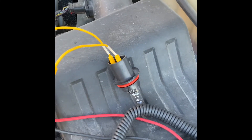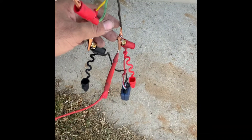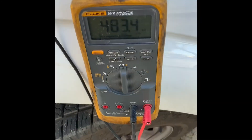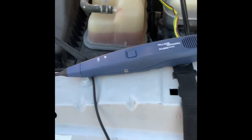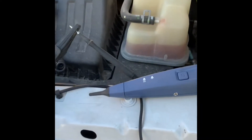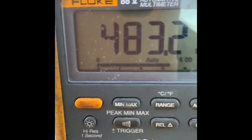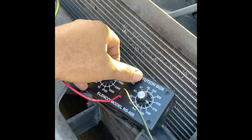Remember, you're trying to find an open, and you can also find out if there's a short — we'll get into that in a minute. What I did is I put one end of the meter at the start of the run with a test lead right there, and we're showing the resistance in the run of the wire. We're at the very end of the wire right here, and there it is — 483 ohms.